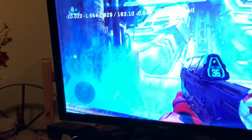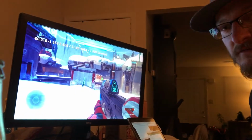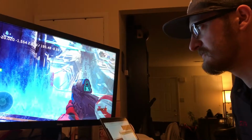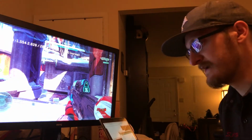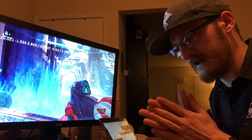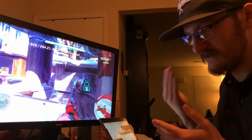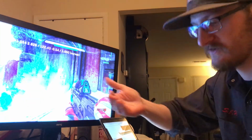And honestly, I thought I had it working pretty well at first, but once I started testing it a little more harshly, I realized that we weren't quite on the mark. So the original code that I had in the test used a delay. I would tell it to wait for 500 milliseconds, activate the relay, and perform a turn for 500 milliseconds, and then halt and wait for another second. And so it would just turn, stop, turn, stop.